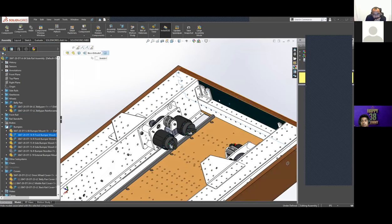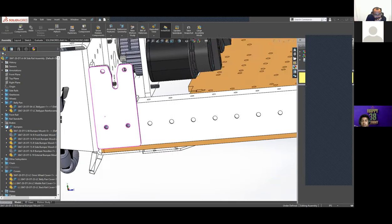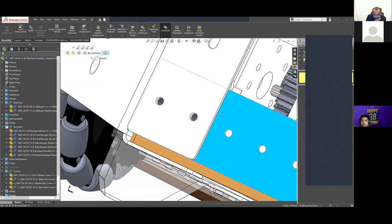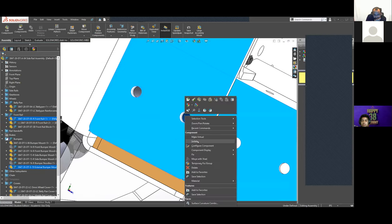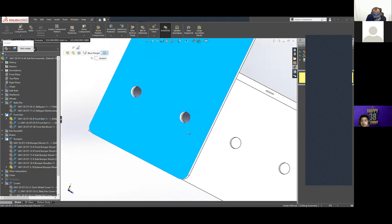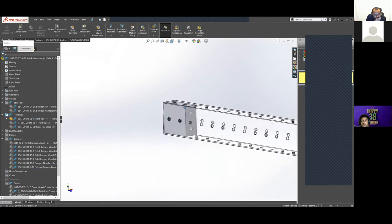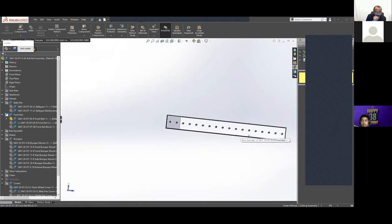The cross rails are mounted by a threaded rod going from here to the other side. To position the threaded rod, there is a 3D printed block in here, which allows us to position the threaded rod and keep it in one spot. There's one on both sides.